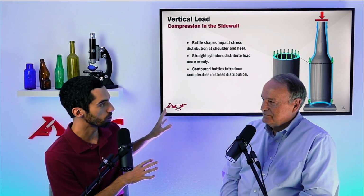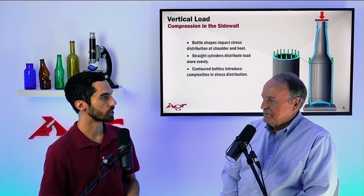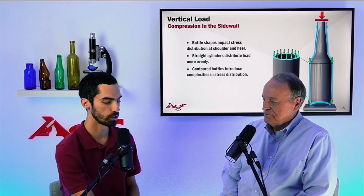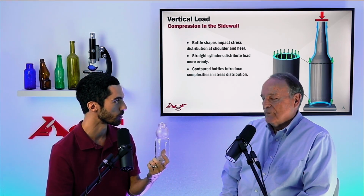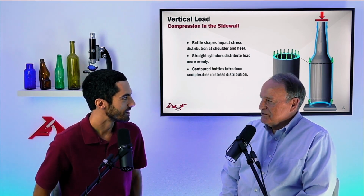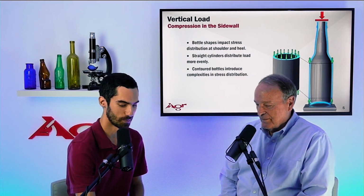As we've talked about before with the testing, we need to make sure that we're testing for the same conditions in terms of simulating that damage. We also need to understand, are we capping something pressurized? Does it need to be that 1,000-pound capping force? Or are we working with something like the snow ball bottle, where the capping forces will be much lower? We can get away with more design features. Depending on that use case scenario, you can get away with some extra things.